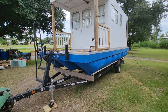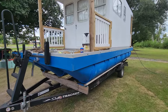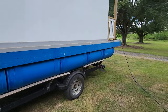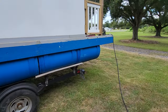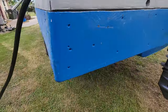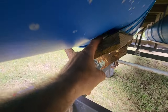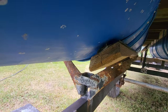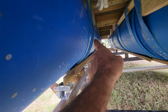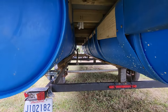I did have a few issues. I forgot to air up my barrels before, so my barrels are sagging, which is causing some of my strapping to look loose. I'm going to need to put 2 PSI per barrel. One of my guides — not Teflon, sorry, it's slices of HDPE barrel — it curled over, so I need to take care of that. You can see I've got a strap that looks loose; this one's kind of loose, that one's kind of loose because I have no air in it. I should have put air in it before I put it in the trailer, but it's too late now.